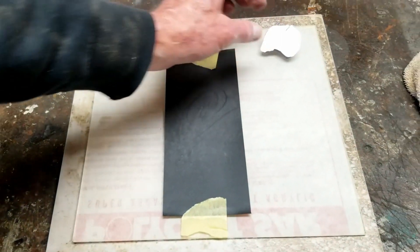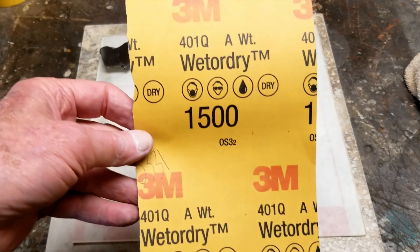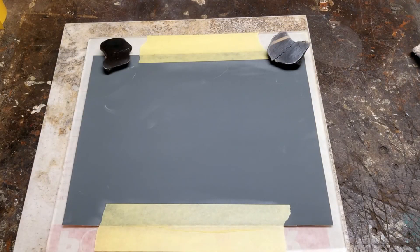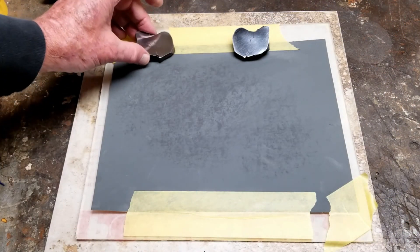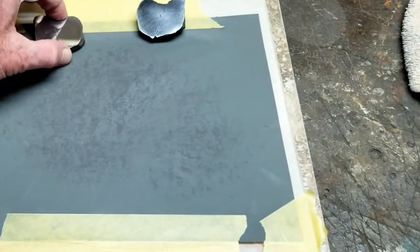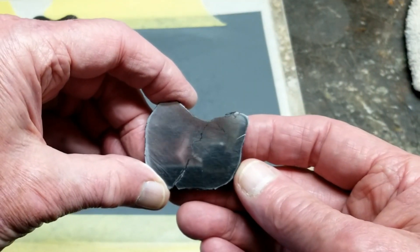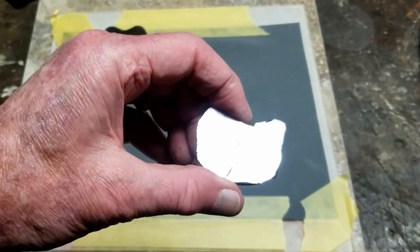I hit on a little trick: instead of holding sandpaper down with my hand, I used a little bit of painter's tape — getting a little clever. Next is 1500 grit. I'm all set with my 1500 grit paper; my two pieces are ready to go, everything's taped down. We spent a lot of time on the 1500 grit, and I think the results speak for themselves — nice and shiny, you can clearly see the reflections. This is about as high a grit as I want to go; above this it's really a point of diminishing returns, and you've got to leave something for the acid to grab onto in the etching process.